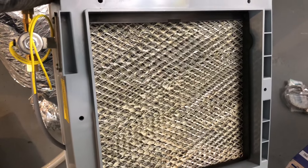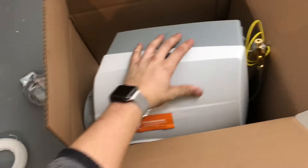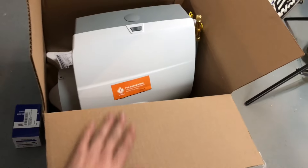The air goes into basically your feed duct on the furnace and propagates throughout your entire house, slowly raising the humidity. This Aprilaire unit is rated for, I think, 3,000 square feet. I have 1,800 finished square feet in this house, so this will be more than plenty.